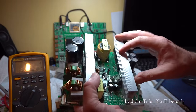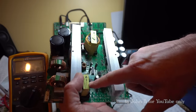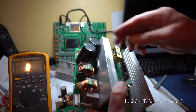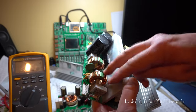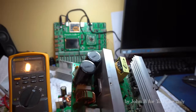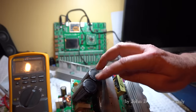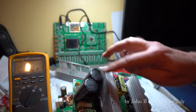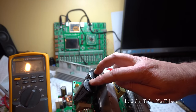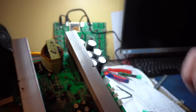And looking at the circuit drawing, break it down into chunks. So plus minus 15 here, plus minus 75 there. So that's like two separate power supplies. That's the filter for the mains input. Stops the switch mode noise getting back out. This has no PFC circuit, which I'm surprised about, because it's over 600 watts consumption. Just rectifies the mains. 320 volts runs into our power supply and we get our various voltages out.